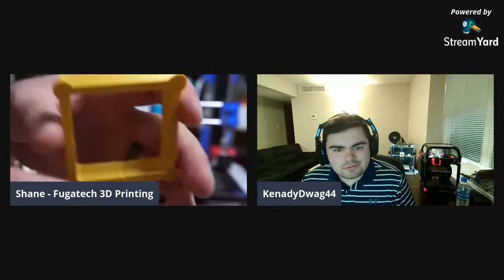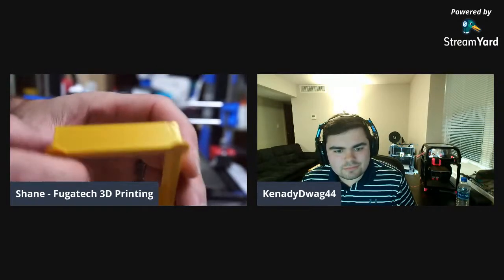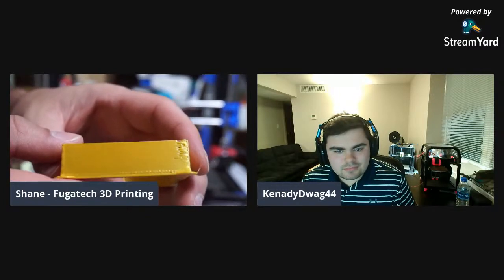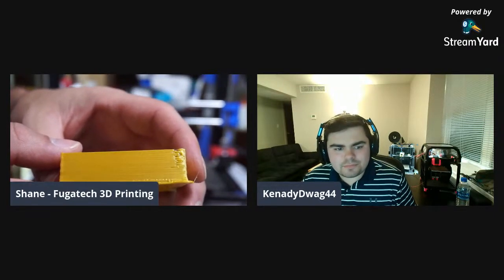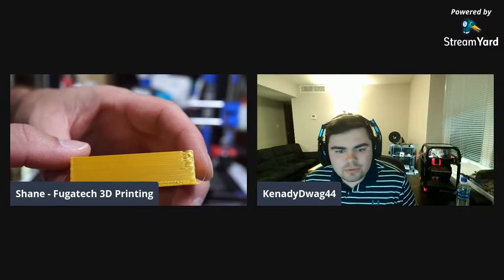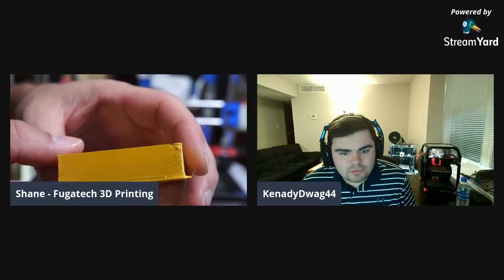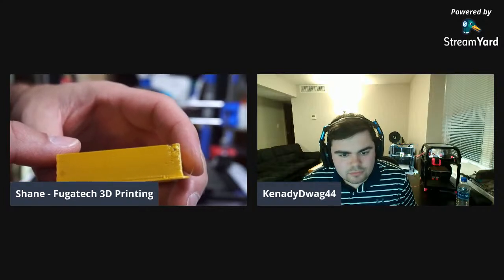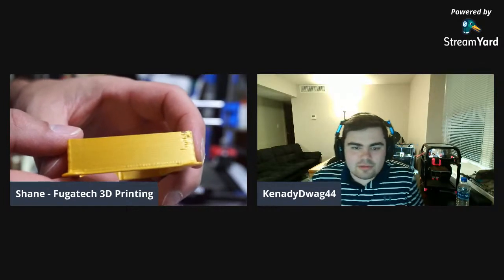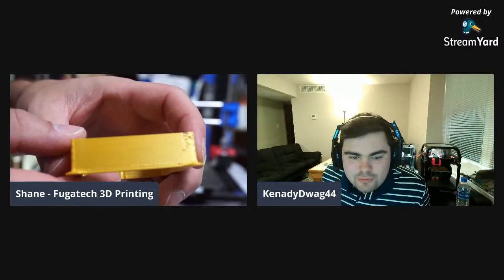Huh. The front and sides are fine, but that back was like, woo. Maybe I didn't have it hot enough for how fast we were going. It was at 215. Maybe. These are big layer heights. Like I don't print this big of a layer. Yeah, this is pretty big. This is 0.37 extrusion height. Yeah, so I mean that may have been a little too fast.